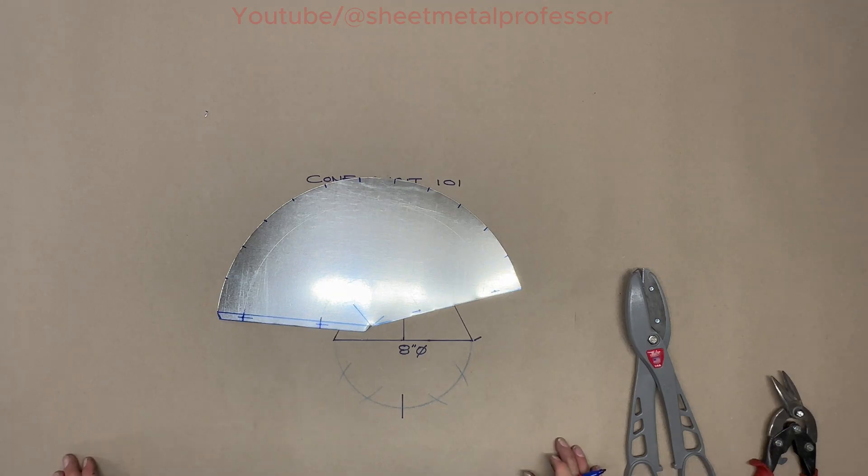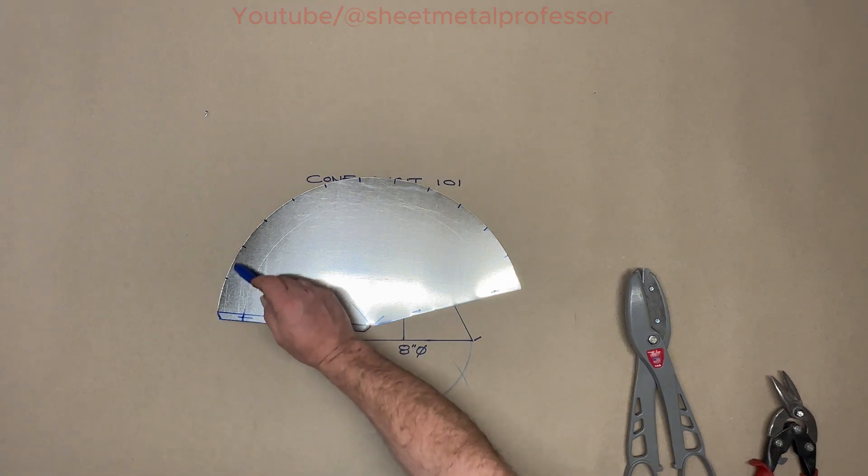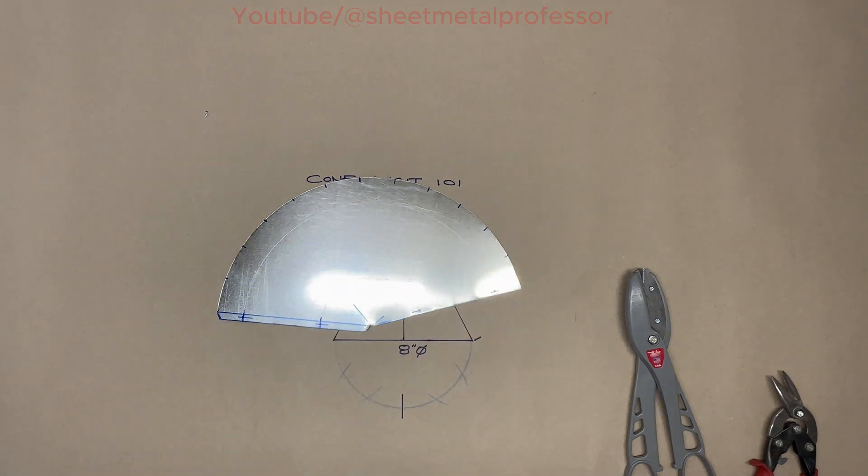But because this is so steep, it's a very wide opening, so we're bringing a lot of material together. So we're going to do this as a dodecagon — we're just going to bend the 12 spaces; I'm not going to roll it. It'll look a little more decorative if you do it that way. And then when you're done, you could roll a hem on it, whatever you want to do. But let's move over to the brake and we'll bend it up.